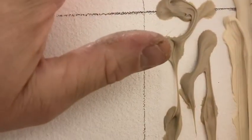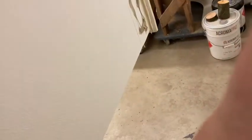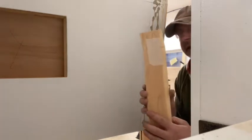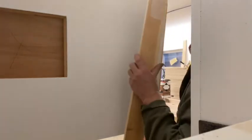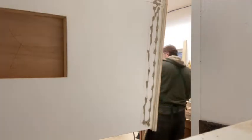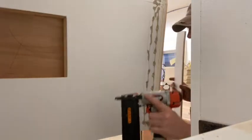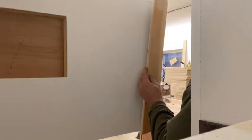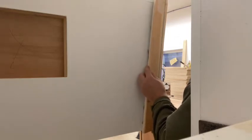I'm just explaining a few little things here, nothing very crazy. This side piece, I did actually glue the miter together. I glued it and taped it together before I put the whole assembly on, so that the joints of the miters were quite tight. As you can see here, I had it taped together in one piece. And then I just peeled it on, and I did run a bead of caulk where this piece I'm about to put on butts into the piece on the front of the camper, to make a nice seal. And it seemed to come out pretty well.